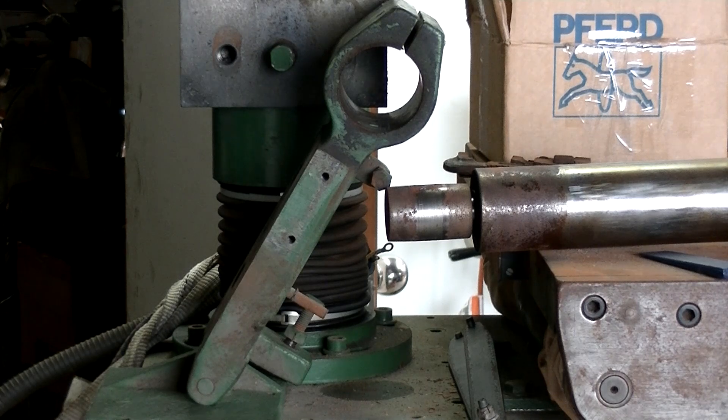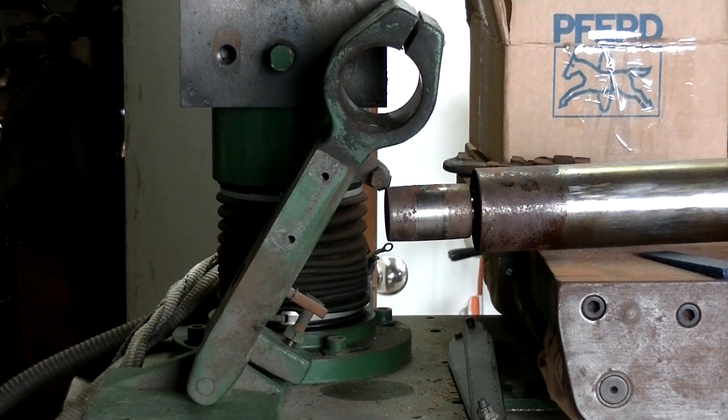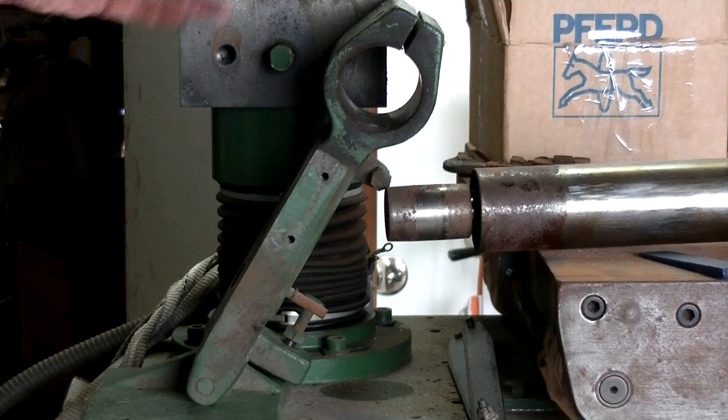I think I've got enough room to get the tripod in there and the camera, and I'll show you where it will be sitting — but overall a little bit of success at last for today. I don't know whether I'll be using the spindle on this unit or on something separate. If necessary, to make it easier to install on the Cincinnati, I can saw that piece off there and keep that as a matching unit with the spindle. I'm sure that spindle will be well used in the future. Even the diamond wheel that's on it still looks quite good, and that'll leave me this bracket to attach to the Cincinnati. There are two big holes that the large bolts went through to allow a little bit of tilt in the head, and I think they will line up quite well with the T-slot on the top of the head — but we'll take it over there and have a bit of a look.